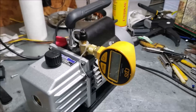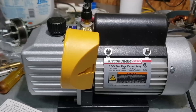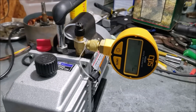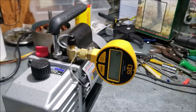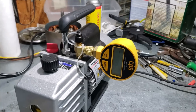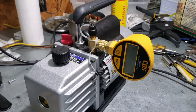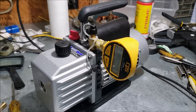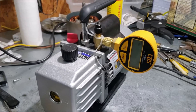If you're going to do any kind of work like this and wanted some speed, that's why I got the 3 CFM - they make 2.5 and smaller ones, but this has done well for me. One thing I'd recommend is to get a micron gauge. Those are really important to determine if you have a leak and to make sure you really got a true vacuum. The standard gauge sets just aren't sensitive enough, and with a micron gauge you can detect a small leak within a few minutes of pumping down. They're not cheap but well worth the money.